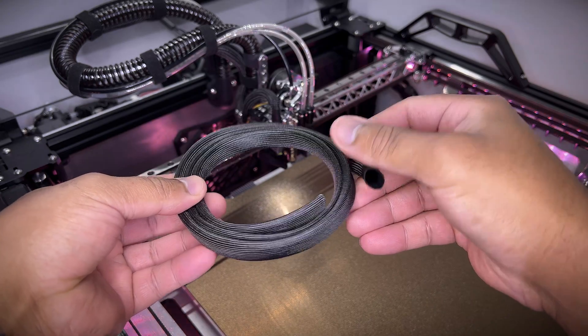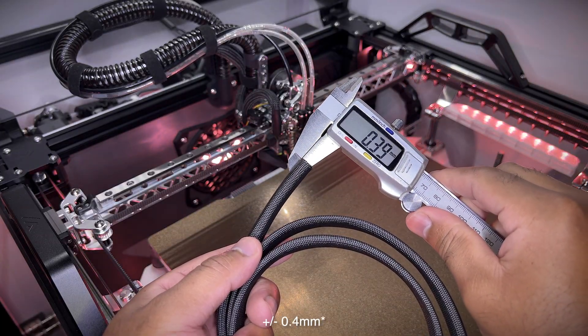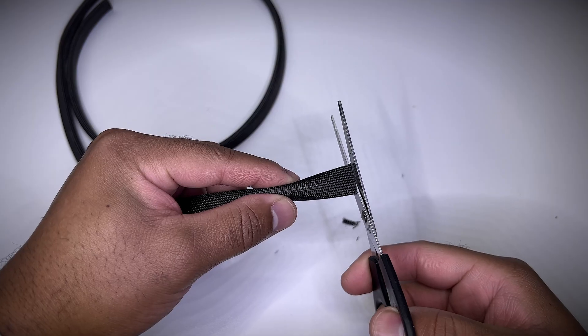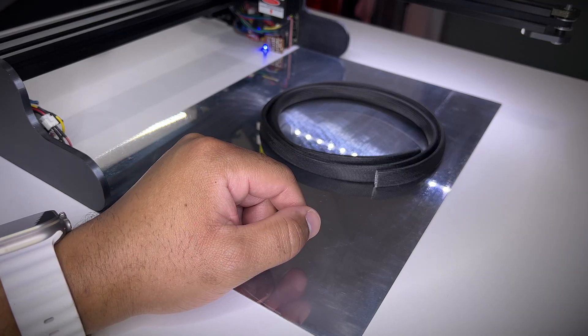To use the heat shield, you will need a 10mm glass fiber sleeve — this one has a thickness of 0.4mm and is rated to 600 degrees. I need to cut holes for the nichrome wire and the temperature sensor, and instead of using a pair of scissors, I'm gonna try to laser cut them with this laser machine I built a few years ago.